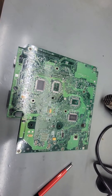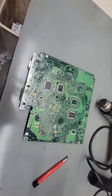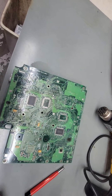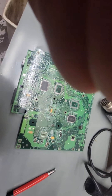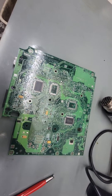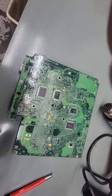I do quite a few RAM upgrades on OGX boxes, and when you do that you have a choice to either buy new chips from eBay or Ali, or you can get used chips from an old board that's dead. This is a V12 with tracerot. I don't like to fix tracerot boards, so I just take the RAM off them. The problem with the eBay and Ali chips is I feel a lot of them are probably gonna be counterfeits, and it's just as easy to take them off boards that you know are working — you know they're not counterfeit.